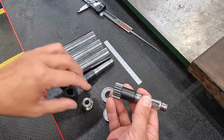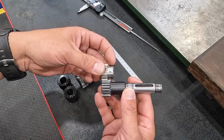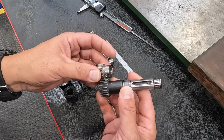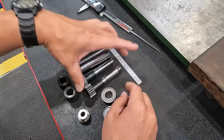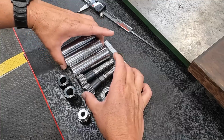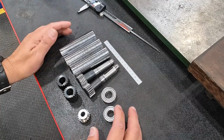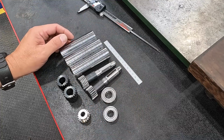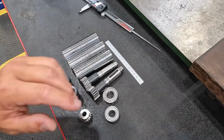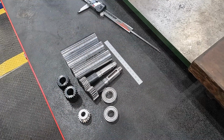And then we'll also, as I said, make it so that we sweat these gears on the end so that they're on there nice and tight, and then dimple it for the set screws there. Okay, so I will come back with a separate video on our journey into hopefully getting some of these shafts successfully machined over on our Milltronics CNC machines.